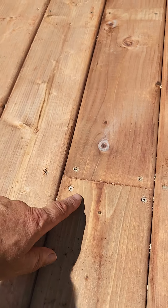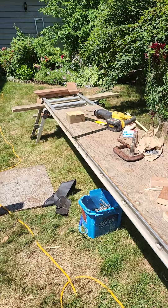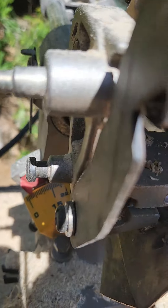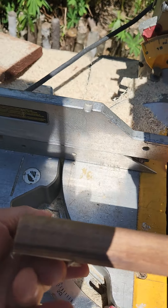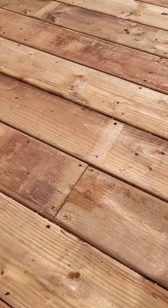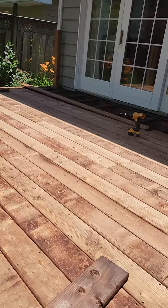For all the joints, when I cut my joints I put my saw on a tilt — not much of a tilt, and I'll show you. If you look closely right here, it's not quite on zero. So when I do my cut, the cut has a little bit of a tilt to it, so that when the top of the deck boards butt together the joints are nicer. A little technique that I thought of, and it seems to work good.